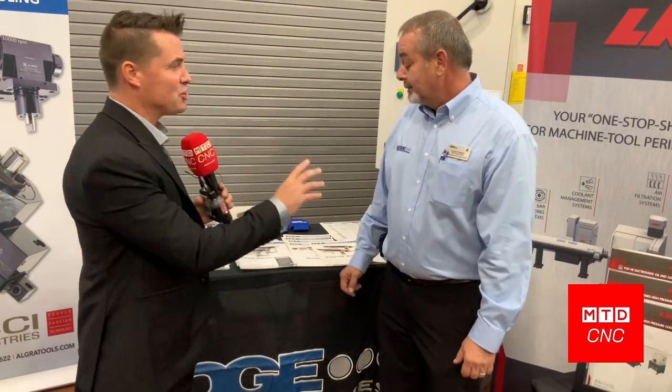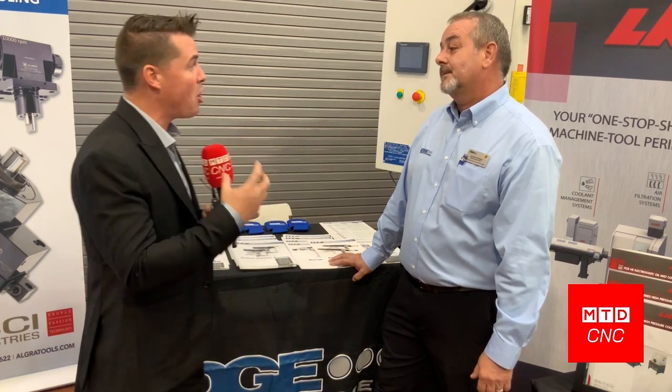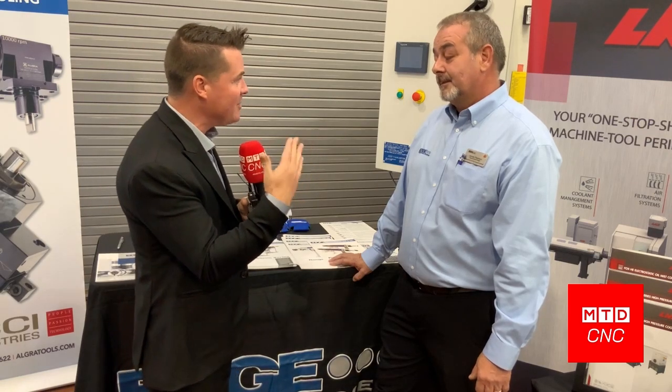I have a question to ask, and I'm pretty sure you know the answer, but because this is never scripted, sometimes we don't know the answer — and that's okay too. And that's bar whip. How do you guys prevent or help against that bar whip? Because when those spindles are turning, sometimes we get that vibration in the part that's going to reduce our cycle time or reduce our tool life, make a poorer finish than we'd like to have. There are multiple facets that go into the domino effect of what happens with that vibration. How do you guys support that?